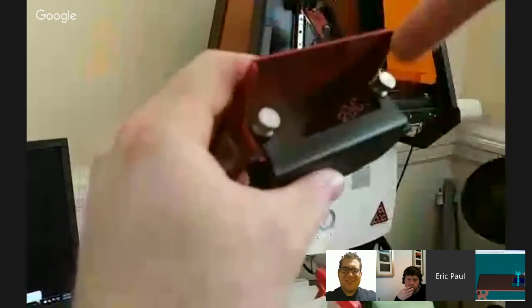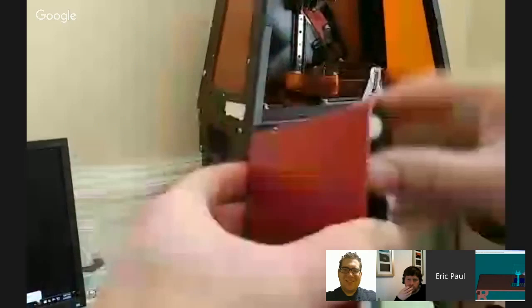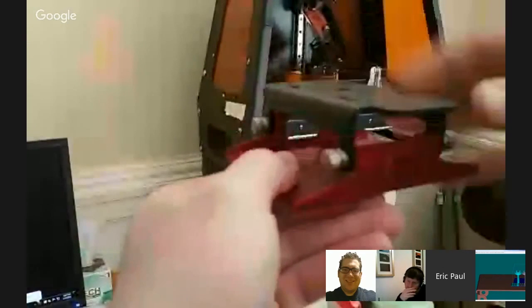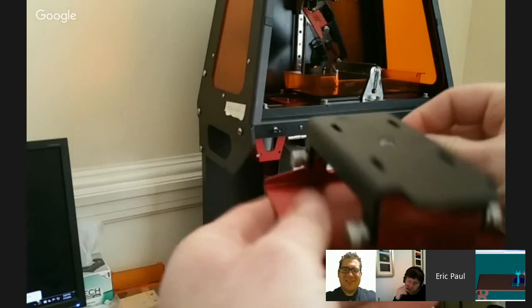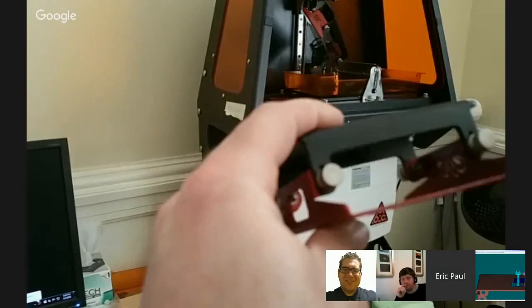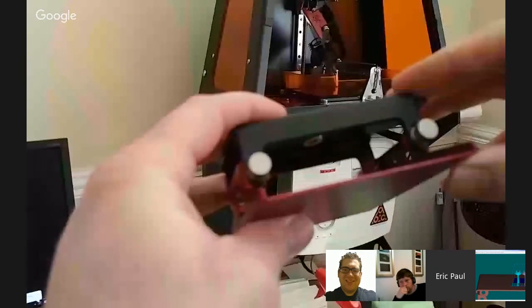I had a tough time getting an Allen wrench in there to tighten up the table, because you have to get this flat with the PDMS. So what I would do is just put thumb screws in here, and that way I'd get it level, and then do each side, tightening it up slowly. And then finally I'd get it to where it'd be tight, and I'm flat, and nothing curled up on me. Because if you over-tighten one of these, it will actually make this edge jump up.